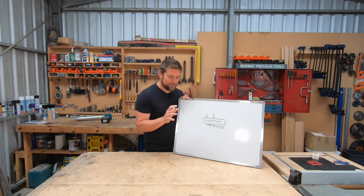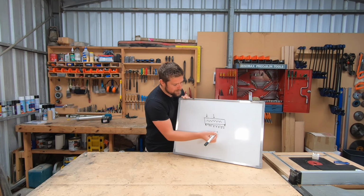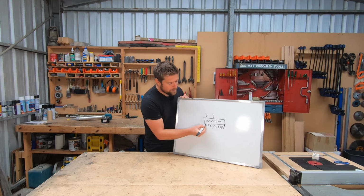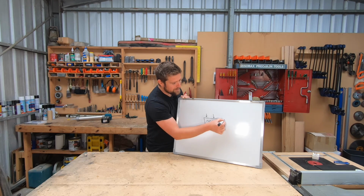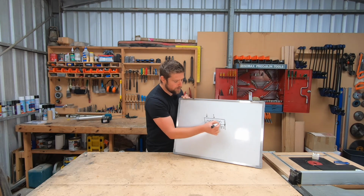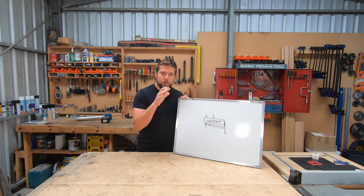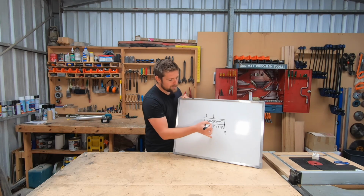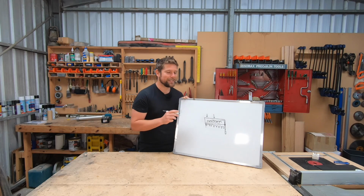Now, to do the double glazing, what I've done is I've put tire valves at either end. And what I'll do is pump inert gas in this end and have a tube that comes up inside here. Now the inert gas is heavier than air, so as I pump it in, it'll slowly fill up and eventually come down out this tube. And at the bottom here, I'll have a candle that when the candle goes out, I know that the inert gas is built up inside and coming out of that tube because the inert gas will put the candle out. At least that's the idea. So let's check it out.